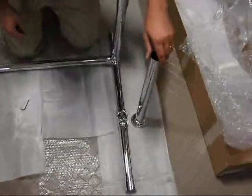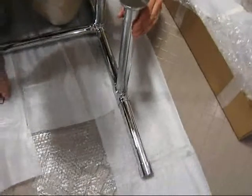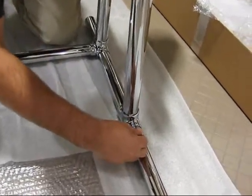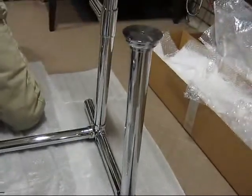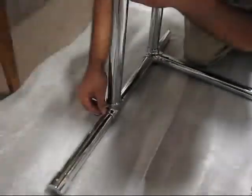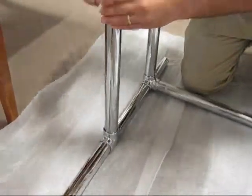We are now assembling the shelf supports. There are the two shelf supports that are included with this leg system. And in a similar manner as we assemble the top horizontal cross members, we're doing this with the shelf supports now, which consists of a horizontal tube and a wall flange at the lower end of the leg. This is the bottom of the leg, this is the top of the leg. And we have two shelf supports which attach in a similar manner as the two top horizontal cross members did. Again, loosely assembling the set screw at this point in the installation.